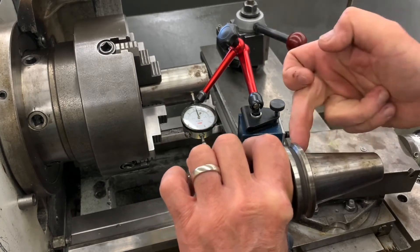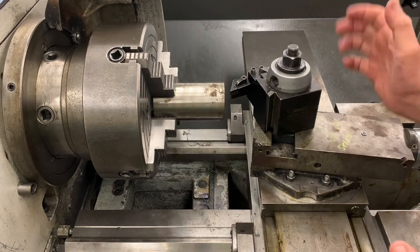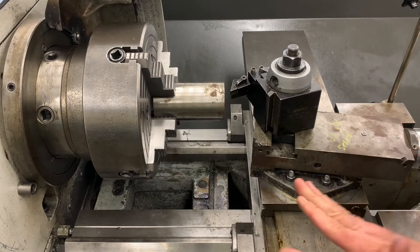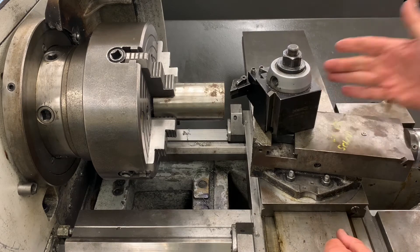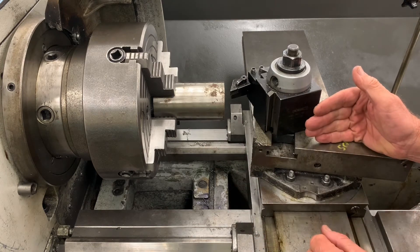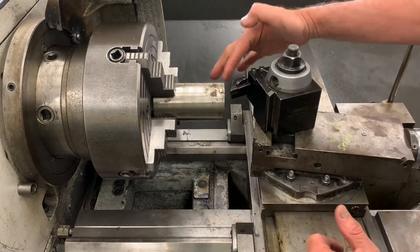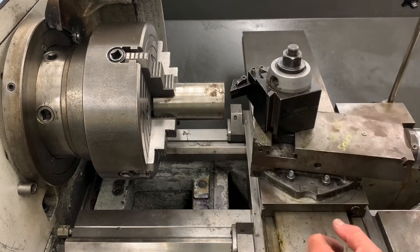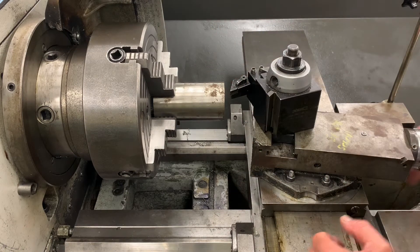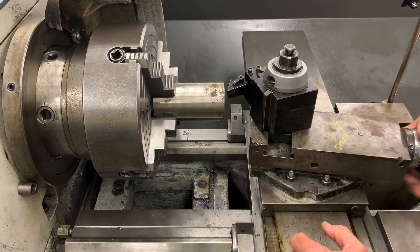This is how the tool and everything is set up to cut the taper on the CAT 40 tool holder. Our cross slide is all the way maxed out, the compound is set at about eight and a half degrees — we just checked it to make sure it's 73 thousandths per half inch of movement. We're going to run the machine backwards with the tool set up on the back side. It's going to be a lot of cranking like this — you can see it moving in and out right here. We can finagle the tool post around since we just want to cut on this back side and we're not cutting very far.